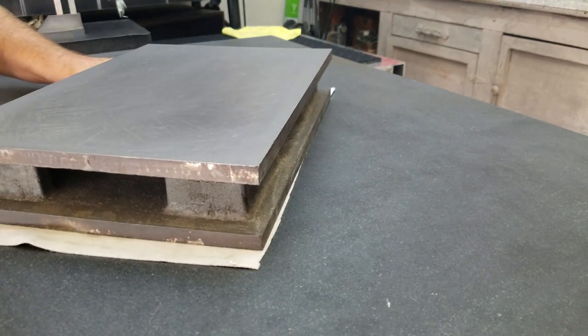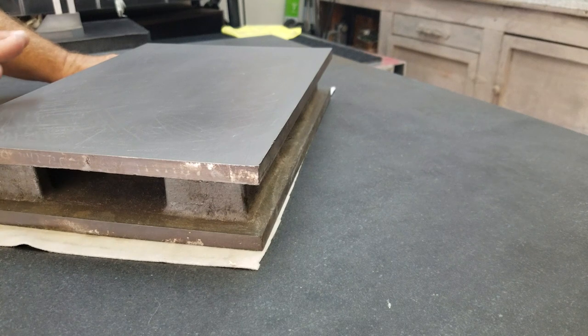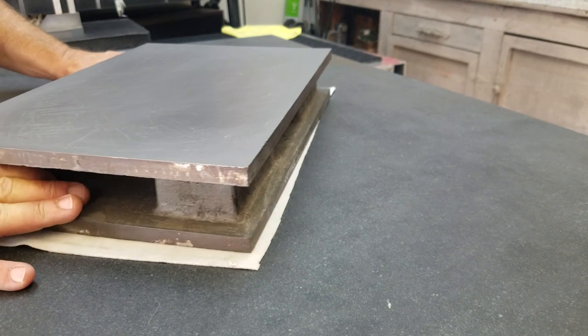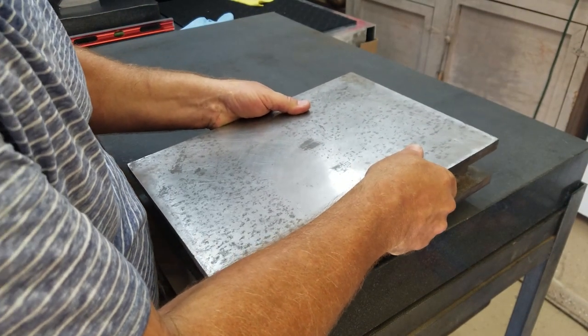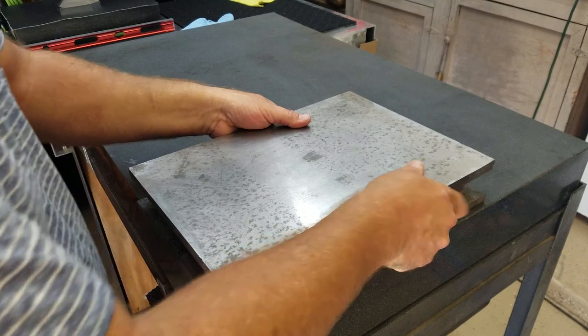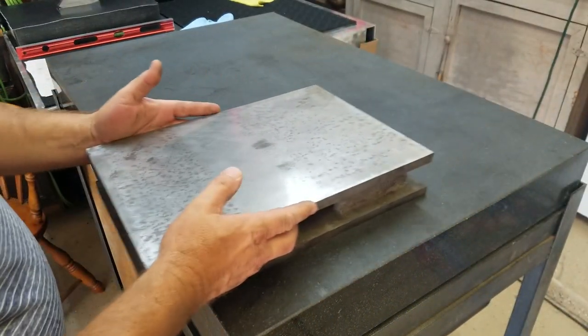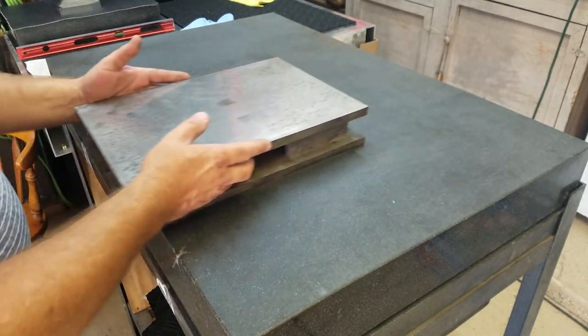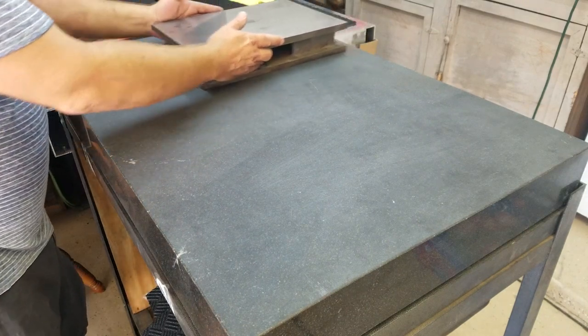But it is impregnated with a 60 mesh diamond, 6040, and it has already been used on another surface plate that we have located behind. We're going to put this down, do a light rub. I'm not expecting it to cut excessively, hope not. There may be some action. So this is going to show us whether we had highs and lows, and where those may be.